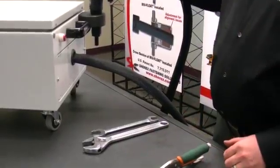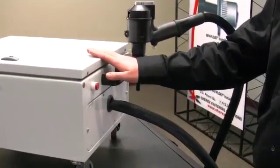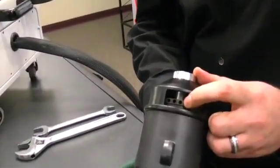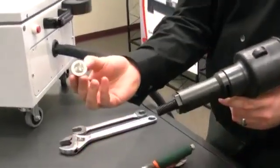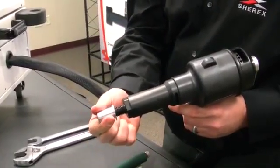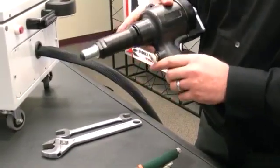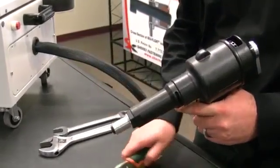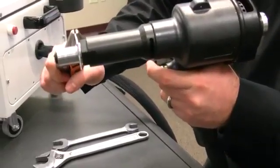To install a rivet nut with the Flex 18, first be sure that your pulling force is set within the hydraulic booster box, or your distance is set with the stop ring if you're using pull-to-distance installation. Next, take the rivet nut, thread it onto the tool a quarter turn, and then by applying a little pressure it'll spin to the anvil of the tool. The single-stage trigger, when pulled, will activate the pulling cycle and then automatically go into reverse. So you take the tool with the rivet nut on the front, place it in your work piece, and pull the trigger.